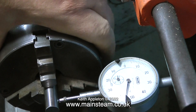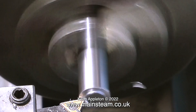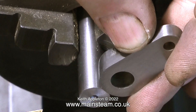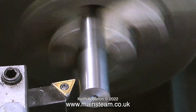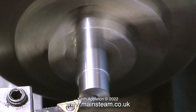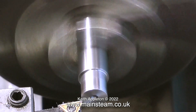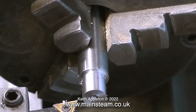As you can see, the DTI needle is moving about as much as a gnat's dick — which is an engineering term for not very much at all. So now let the turning commence. First I face across the end as before and use the center drill, then I mark the silver steel with the lathe tool so I know where to cut to. I take a good roughing cut, getting rid of a lot of surplus material in one go. Even though my boxford lathe is quite old, it still cuts very well without chattering.